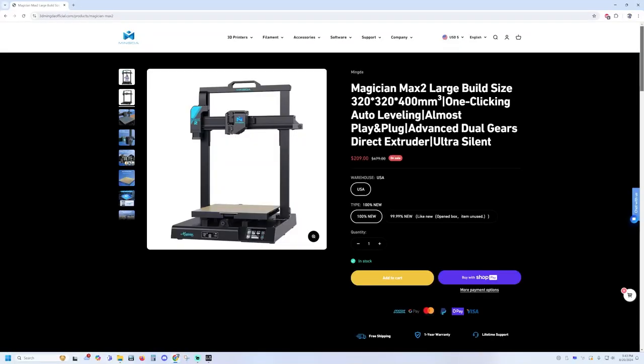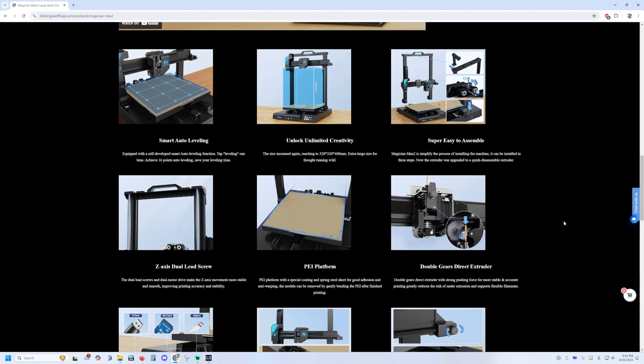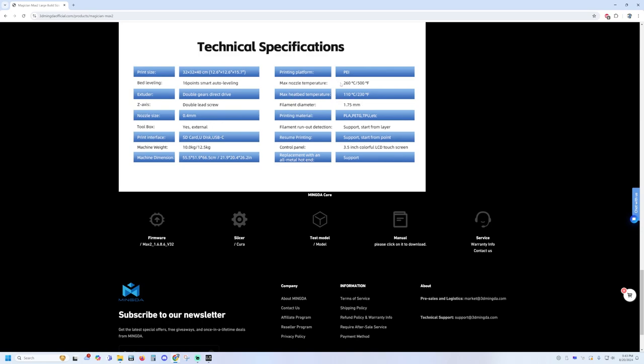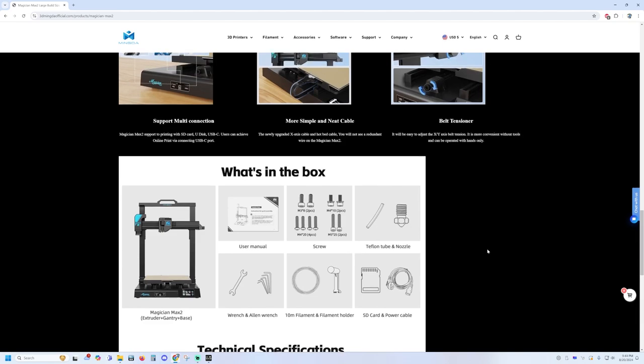On the website, as I mentioned earlier — right here — $209 on sale. I don't know how long the sale will last based on our film date at the tail end of August. I know someone's going to ask: did I print PETG or other materials? I just stuck with PLA and PLA+. The hot end says it can do a max nozzle temperature of 260, but I don't have a lot of information on whether it's an all-metal hot end. I see a Teflon tube, so that tells me you definitely don't want to cook Teflon because that will off-gas nasty stuff. Definitely contact their support if you're thinking about doing that.